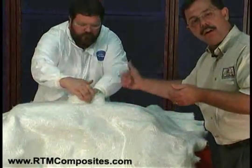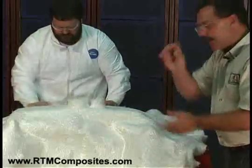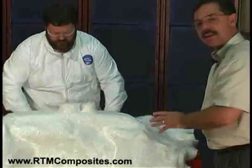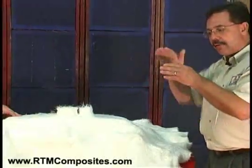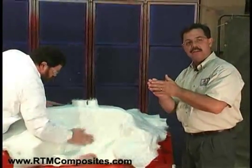When we close the mold, it will also touch the upper mold. We want that entire area — cross-sectionally as well as everywhere else in the part — to be filled with fiber. We don't want the fiber bridging through as the radii and geometry changes in the mold.